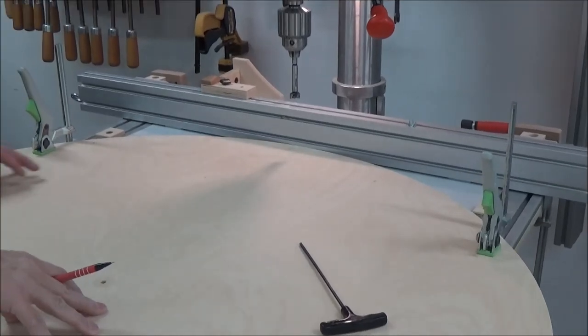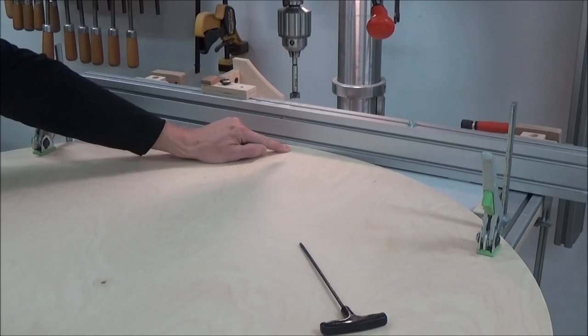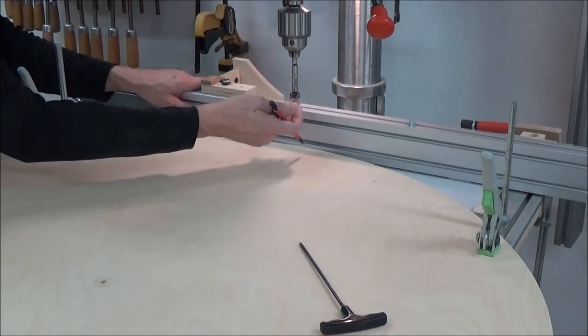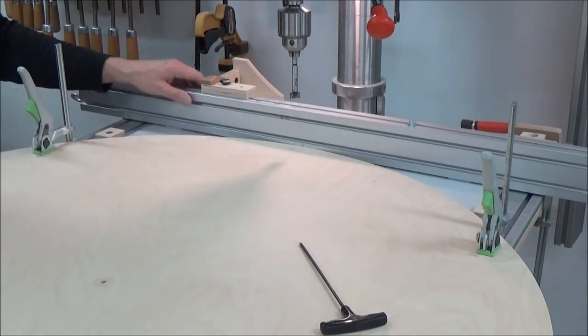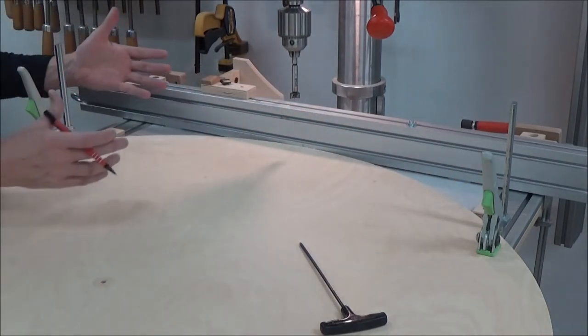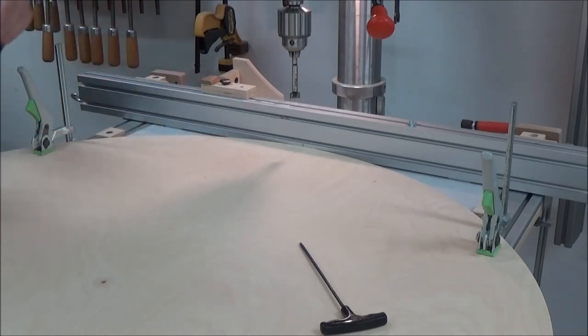So I took a little time to set this up. I drew straight lines through the center pin here to my locations. You can see if I had drilled on my location, I would have been a little off. Inch and a quarter from the back, or from the radius, I should say. I'm going to make a pencil mark on my fence here. And I've got stops, so that I've got 3 points of contact. When I rotate this, I should be right on the money, I hope.